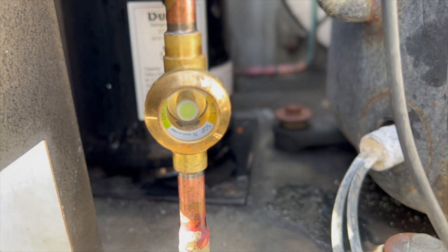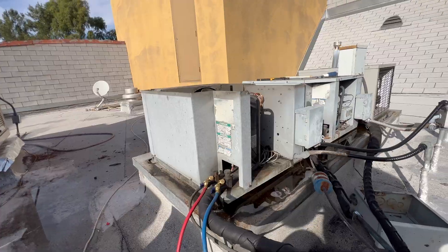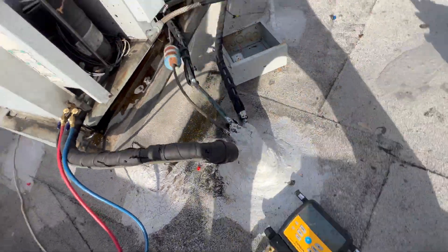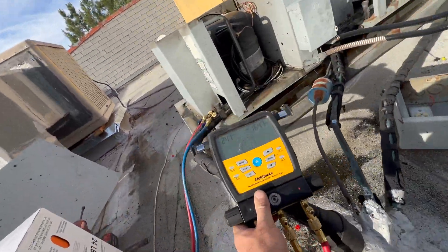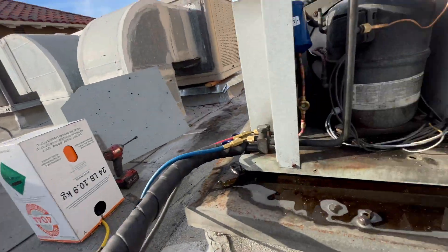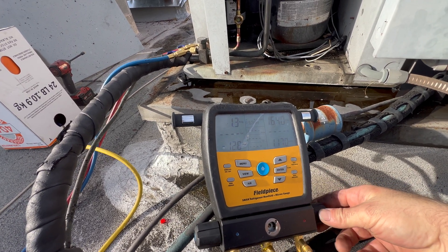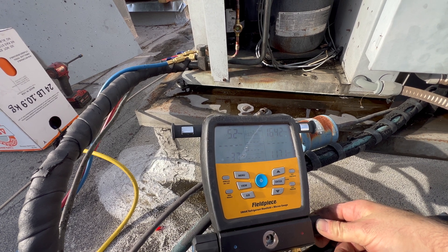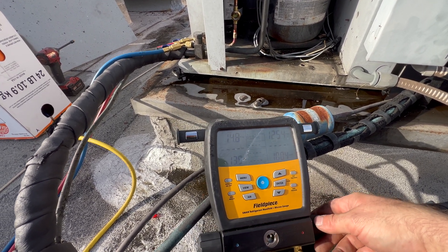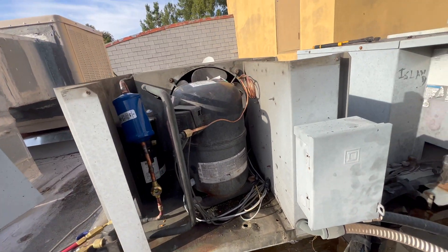It's coming up. I'm still gonna run it for a little bit. Solenoid should be open now — it's in cool. Let's start to charge it up and see where we get. There's about two pounds in that jug so I had to bring another one in. It's supposed to come on around 20 PSI or so. I'm gonna get it to 25, maybe 27.